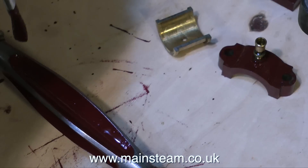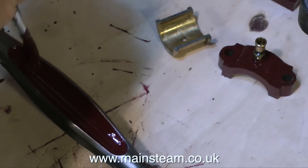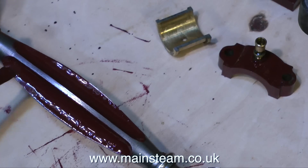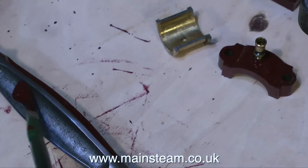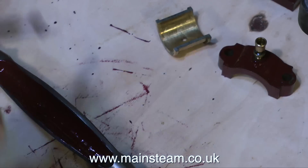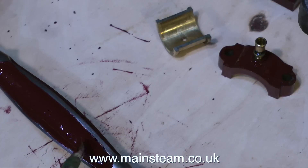A few painting experts are probably thinking: well he's not using any primer, what's going on? The reason is I don't use any primer because I do find the primer comes off — even etched primer comes off. The paint doesn't just fall off; it's usually from some sort of physical damage, and then you end up with a big lump out of the paint because the combination of primer and top coat makes the paint coat thicker. Whereas if you damage this thin layer of paint, you can quickly get a piece of wet-or-dry paper, rub down the paint, and touch it up with a paintbrush dipped in the same paint pot. From my experience the best stuff to use is two-pack paint and spray it, but you need breathing apparatus and lots of gadgets which I don't have. So I just carry on doing it this way — it seems to work for me.